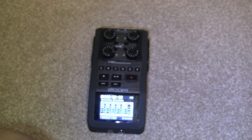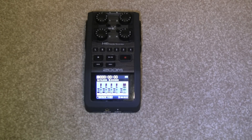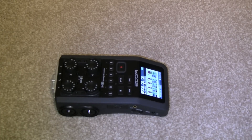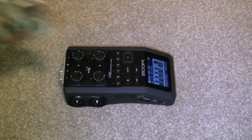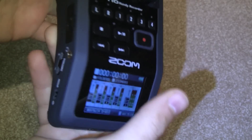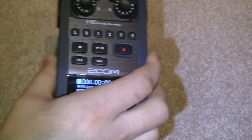One of the big advantages of the Tascam is that it records a backup track at a lower level. So if an actor suddenly shouts and you peak, you can go to the backup track. The Zoom H6 does have a backup track — I've seen it advertised on their website — but what they fail to tell you is that it only applies when using the top module. If you plug in an XLR mic on the side, those do not get a backup track; it only comes from the top module. That's pretty disappointing — it makes it borderline useless if you're using XLR mics on the sides. You can't actually see the levels either, which is another drawback. Other than that, headphone input, volume control, and hold — that's pretty much it looks-wise between the two devices.